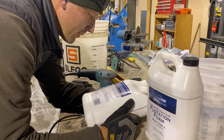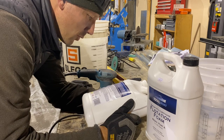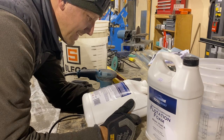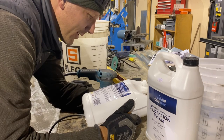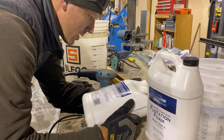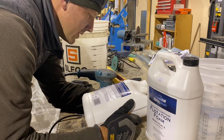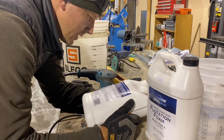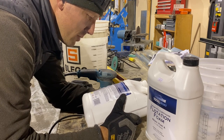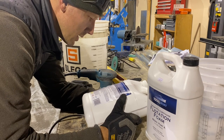Polyurethane foam has roughly 400 seconds of rise time, just under 7 minutes before the reaction is complete. So there are no second chances. Oh, this is getting better and better. Once mixing begins, there's no going back. The point of no return. The reaction is a thermal reaction which generates heat. Ooh, even more exciting. And since this heat is momentary, it poses no problem for polyester, epoxy, laminate materials.